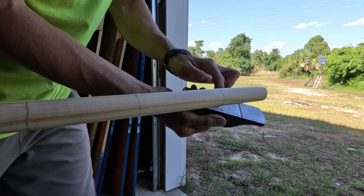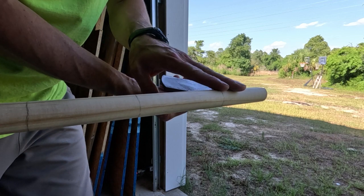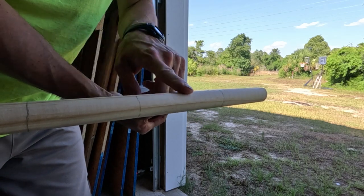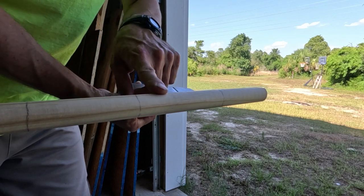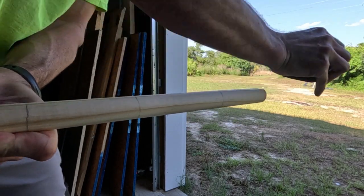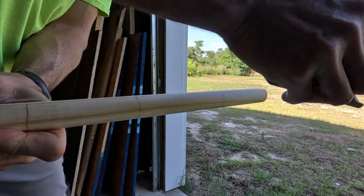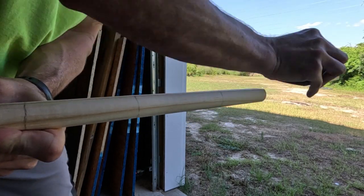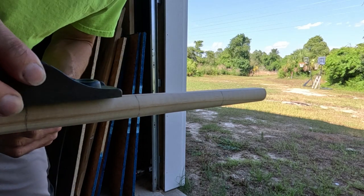Remember, the block plane has a sole to it, so it may not grab everything evenly, because if this has a bow in it or has a point, it's going to take more material there. So we made 5 passes here, and we'll scoot back and make these passes again, and now it will include and take this bit too. So now we have an edge here. This will start to take that edge, and then it'll take this away as well. And then we just work our way all the way back.